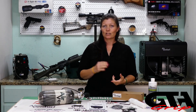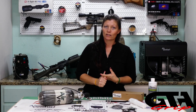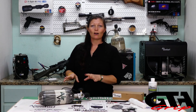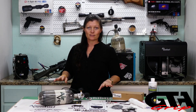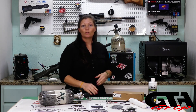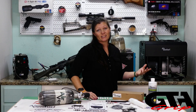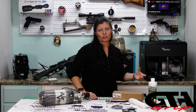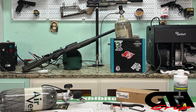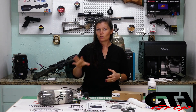That doesn't mean you can leave the compressor unattended — definitely do not do that. Be there to monitor the temperature, make sure the automatic shutoff is working, and check the air periodically to make sure it hasn't gone over, because you do not want to overfill tanks — that is definitely dangerous. It plugs into a standard 110-volt outlet, so no extra electrical work needed. You can also use this compressor for PCPs, carbon fiber tanks, airsoft, and paintball.